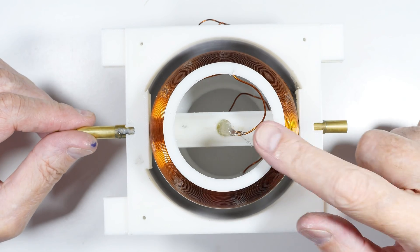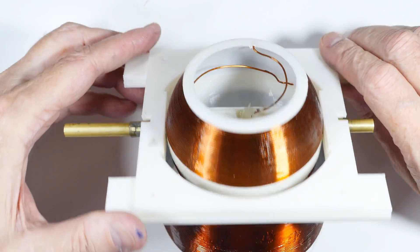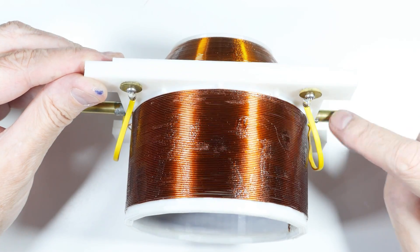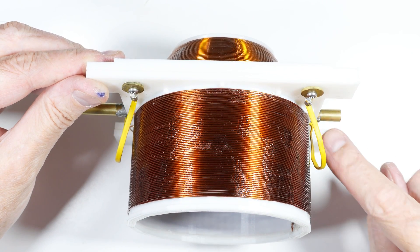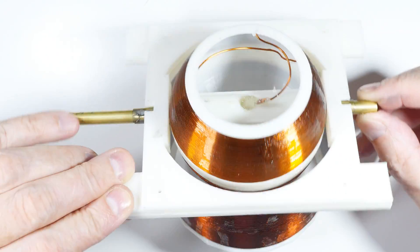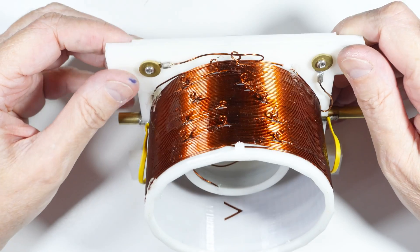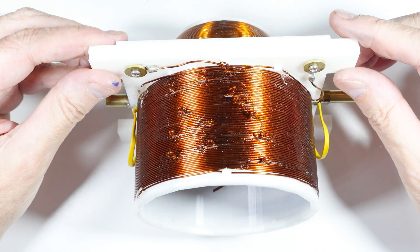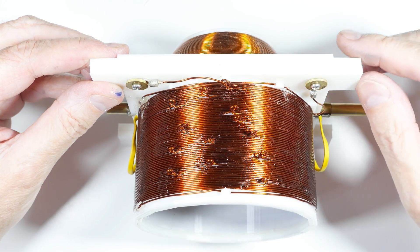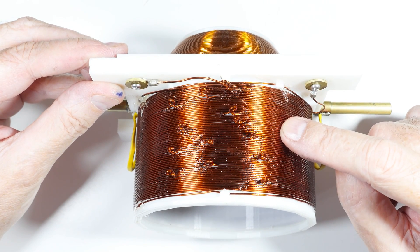This is a beta version of the ball — a version I already had printed up — and the newer ball will work just as well. Here is the bottom side where you can see the connections for the shaft. I use the same commutator-type arrangement — just a brass bushing to transfer the electricity. Now on the other side, you can see all these taps here — that's one of the differences. In variometers you will see taps, but they're not as common.